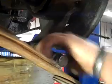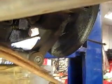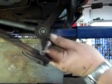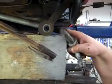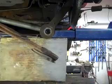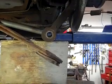It's already started. This shock mount has been on recently, it looks like, so it's coming out pretty easy. We did support this so it doesn't fall haphazardly while we're taking it out. Somebody's been in there — a lot of times you have to use heat or even a torch to heat this up and use the spindle locker to get it out. We've gotten a lot of trailing arms in here where these are absolutely rusted tight and the customer has actually just sawn the strut rod off just to get it off the car — that's how rusty these can be.